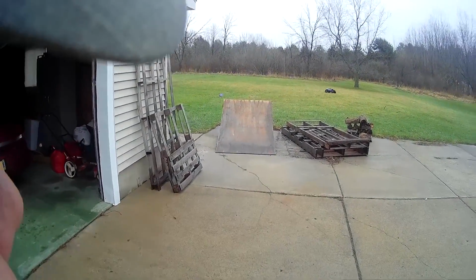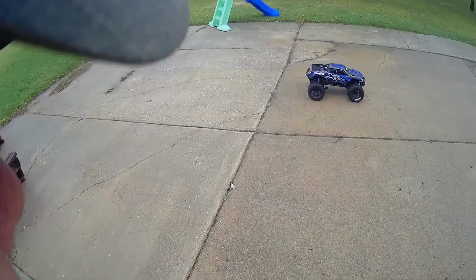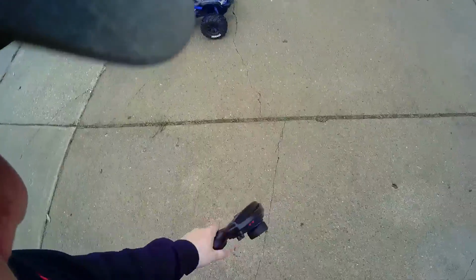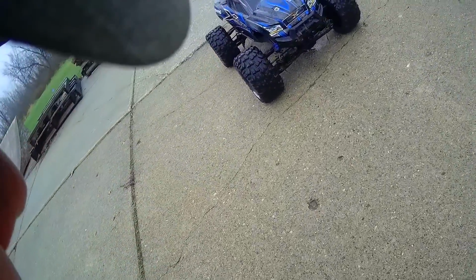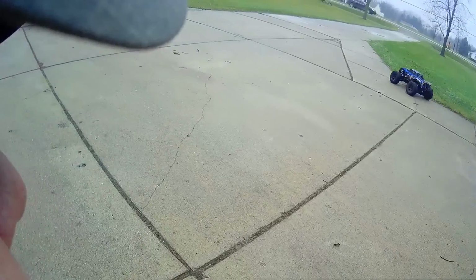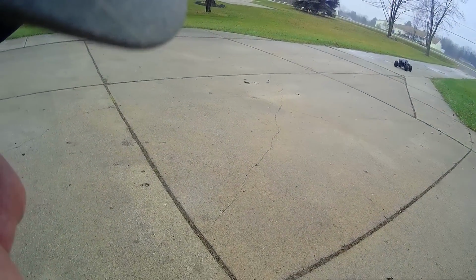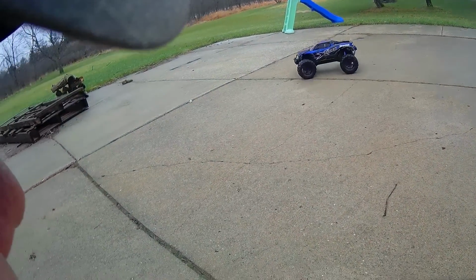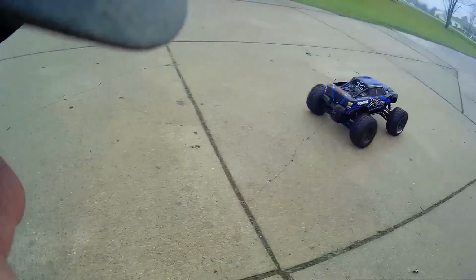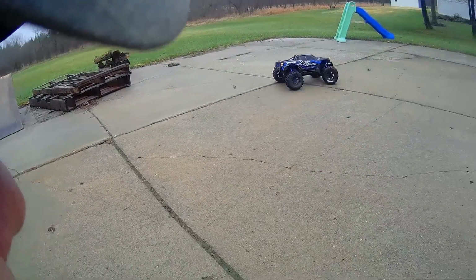Oh, yummy. Oh, this will be fun. It's dripping. Ooh. Oh, it's just a wet slipper, I think. Yep, that fluttering, you hear that? That's a wet slipper. So you don't want to keep hammering on it like that.